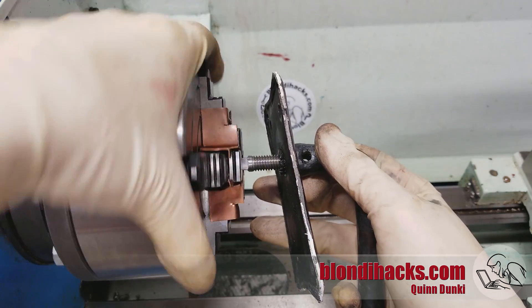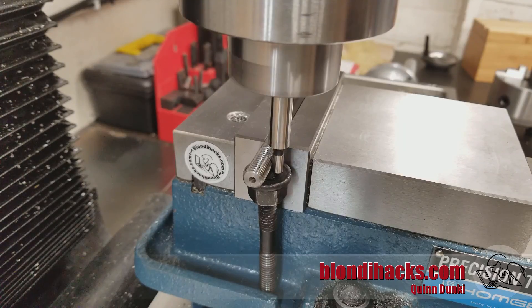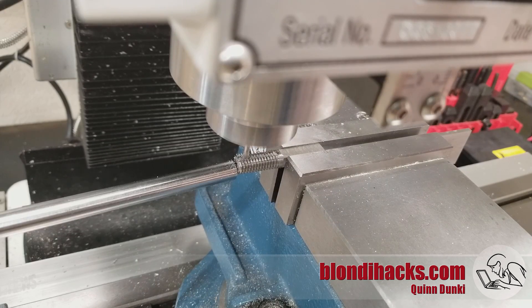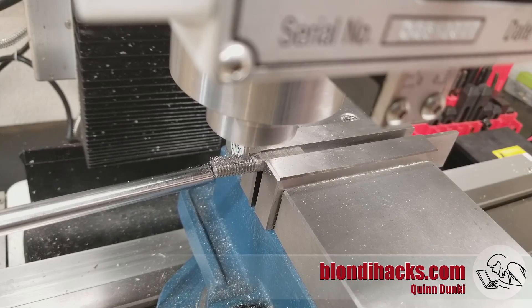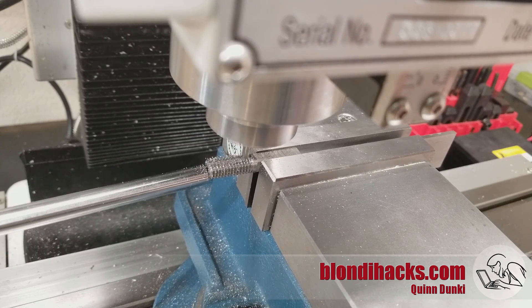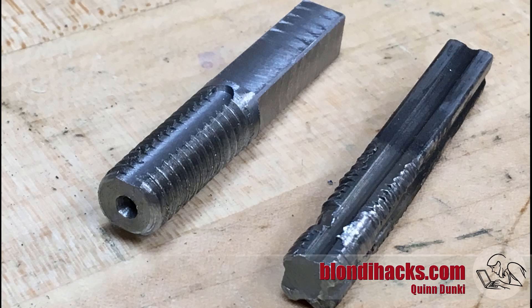Let's do a little test fit on the handle with the newly cut threads and it fits perfectly. Back to the mill — we're going to center it up again using the edge finder and mill the slot for the set screws in the handle. The original had four slots but it really only needs two. I think the original was just made from stock that has those grooves already in it, so we're just going to mill these two slots here. Once again I'm using an end stop so I can easily index the far side. Here's our newly made version of that original part.